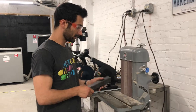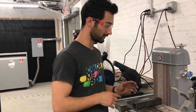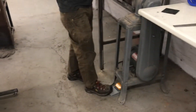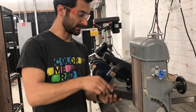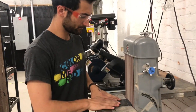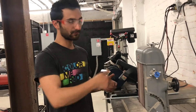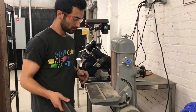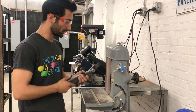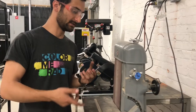When you are ready to use it, you're going to have your stock on here and move it up to the front. I'll demonstrate first just how to use it quickly, and then we'll go over how to change the belt. You can grab material like this and fire it up. As with all power tools, you want to make sure that the machine is fully spinning before you touch the workpiece. If you were holding it against the grinder first and then turned it on, you wouldn't be happy — it would seize up because it needs to get up to speed first.